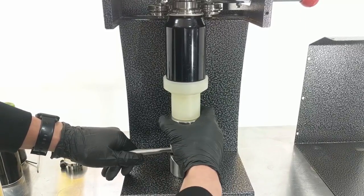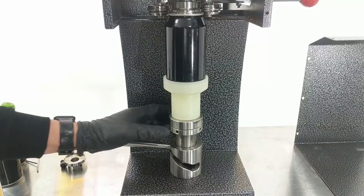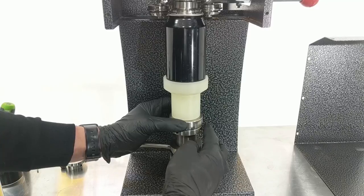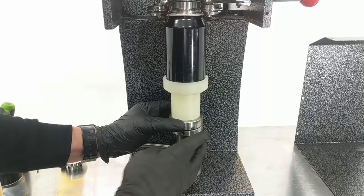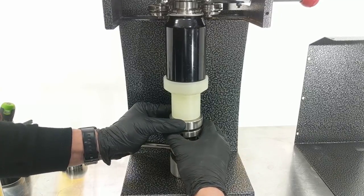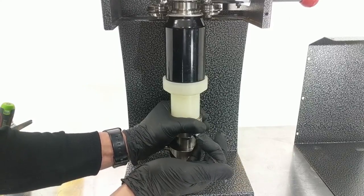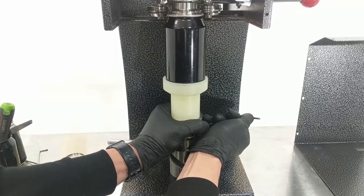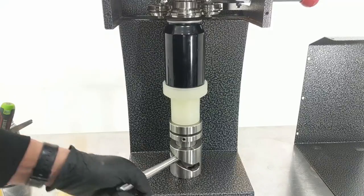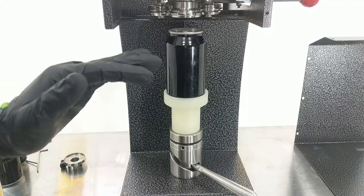Once I can just engage the handle and push it all the way back to the bump stop, I get the coupling ring and hold the upper stainless piece while turning the bottom ring with the holes in it downward to lock it. Don't lock it in the up position — turn it clockwise downward to lock. Then get the allen key, hold the top piece of stainless, and tighten the coupling nut to firmly lock it into position. You hopefully won't have to adjust that again for around 50,000 cans.